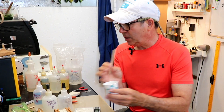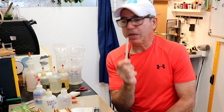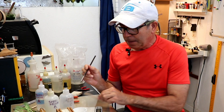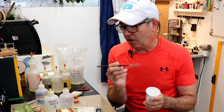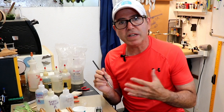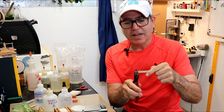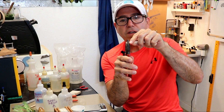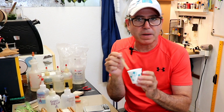That's why you always want to use a flat stirring object — whether it's a popsicle stick, a tongue depressor, or whatever it might be. Don't use a circular stirring stick because that makes it really difficult to scrape off; you'd have to do countless little scrapes to get it all off, and you don't want to do that, especially with a quick-setting resin like these casting resins. Also go ahead and cut the circular part off your popsicle stick — I always cut it on a little bit of a skew so I can get into that corner at the bottom of the cup really easily.